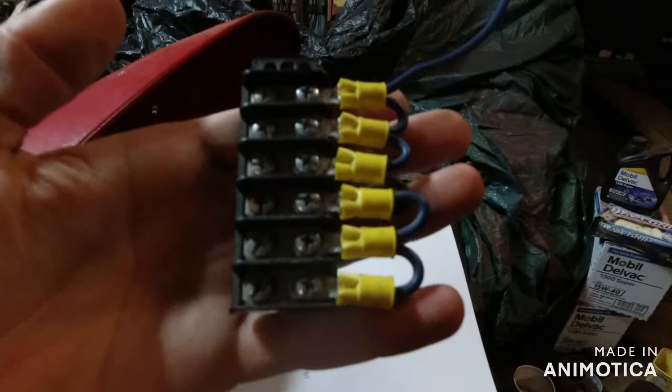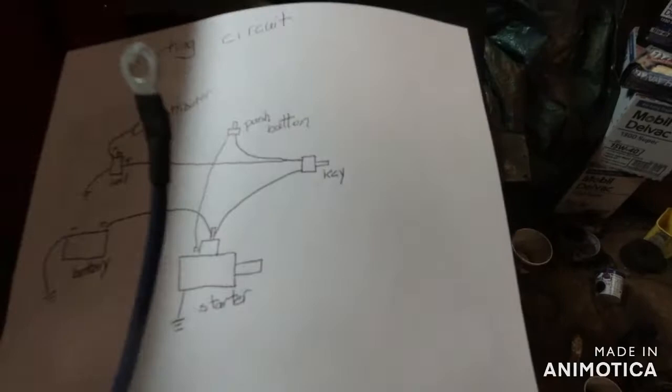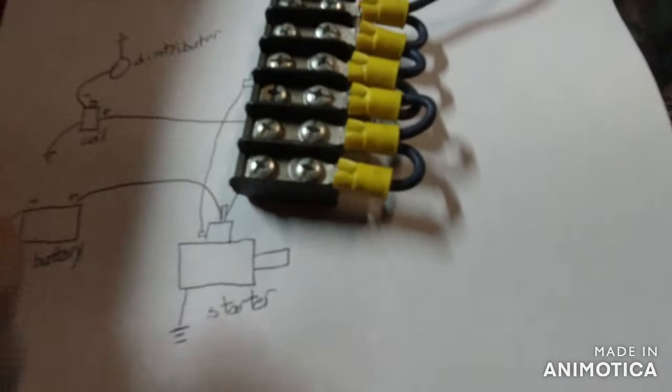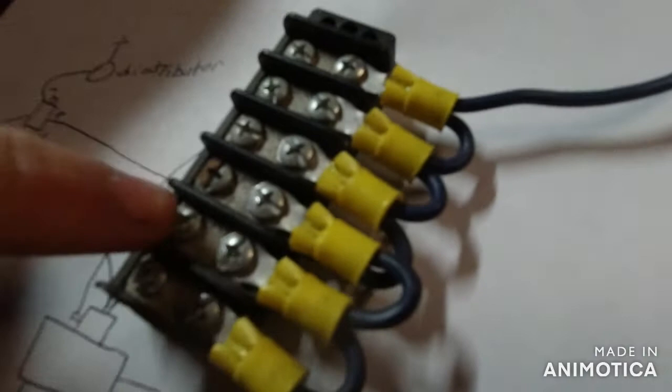But what I'm doing is I'm running this junction block. You can buy these on Amazon, eBay, all that stuff. But you can see I'm going to hook this into the key. So that'll be hooked up right there to the one side of the key that has power on when you turn the key on. And then here, now with the way that we have this set up, there's power running to all these as soon as you turn the key on. Well, I can run this one to the light switch, this one to the distributor, this one to my fuel gauge, my amp gauge, and then